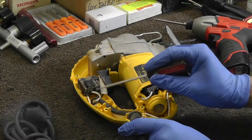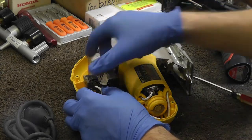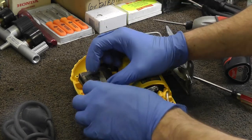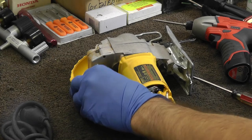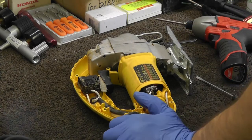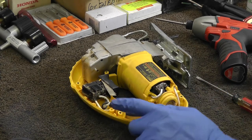Also look at the cord — make sure you don't have wires actually bare. Make sure the insulation is covering the wires and that it's not touching anything. Make sure all the wires in the switch are installed securely; this is like a push-lock kind of installation here where the wires push and lock into place. Make sure you tug on them and you can't remove them easily. The switch you can test with a multimeter, but some switches are a little difficult to test. Look for the obvious: make sure the cord isn't frayed. When you run it, wiggle the cord. You can even tap the tool with a rubber mallet while it's running to make sure nothing is loose and you have no shorts.